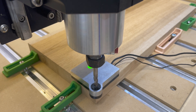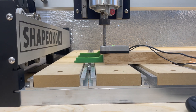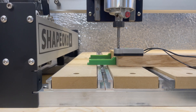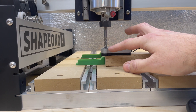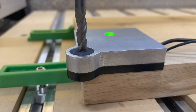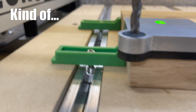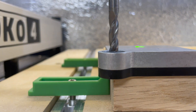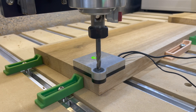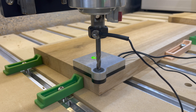Here what I like to do is to be really, really accurate. What you want to do is have your end mill just go under the rim of this circle. You can see that I positioned the end mill in the middle and it's just going below the rim. After you position the end mill in place, don't forget to attach the little magnetic piece to the router so you can close the circuit.